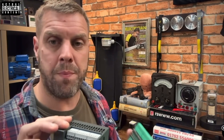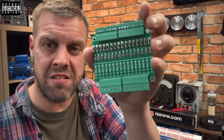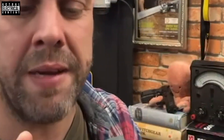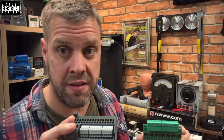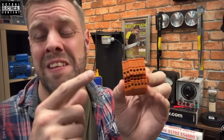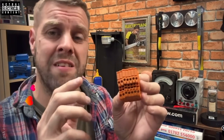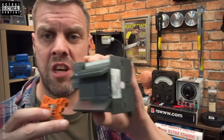That's the tactic I'm going for. Think about how you want to design your rig - where is it going to live, how are you going to store it? If it's on little plates you can store it in a box. If it's on a big piece of wood you've got to store it like a train set behind your bed. I'm going to make a plate that holds my PLC and associated things on a DIN rail, and probably a plate that holds this IO card simulator. These are cheap but expensive to replace - they've got little shitty terminals on them. All of these parts are going to go to terminals on my rigs - DIN rail terminals. I'll show you: these are the terminals I'm going to use.